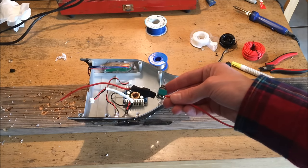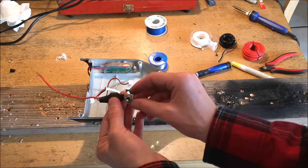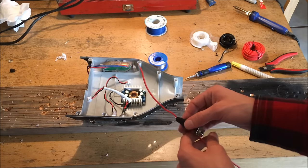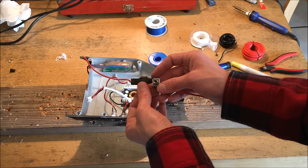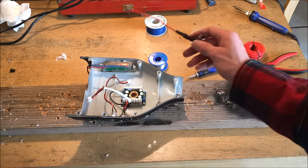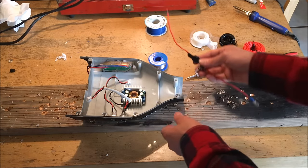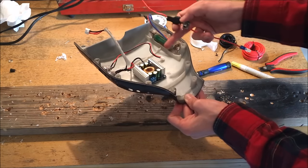In the previous section I forgot to tell you about another part of my system: the inner wiring harness containing the switch as well as a bank of diodes. I put these diodes in for two reasons. First, it prevents any damage should the wiring be hooked up backwards by accident. Secondly, this buck converter is only rated for a maximum input voltage of 40 volts, but my battery produces 42 volts. These old-fashioned silicon diodes will impose roughly a 1 volt forward voltage drop, so it should make this buck converter run closer to its nameplate rating and be less likely to fail as a result. I'm going to mount the switch into the drilled holes and also mount the barrel connector and wire it to the output stage of this buck converter.